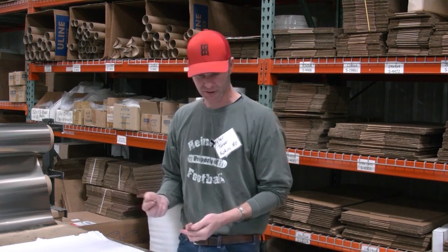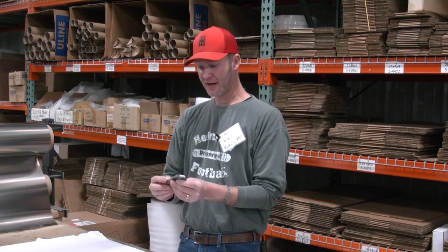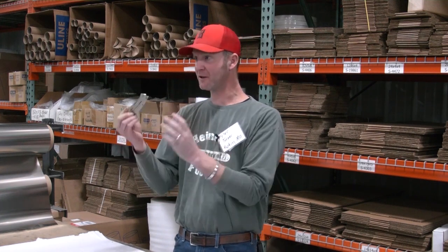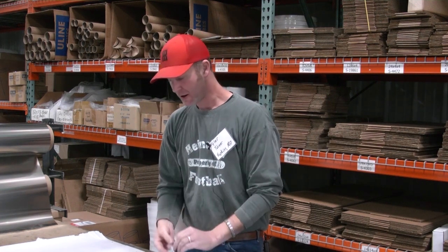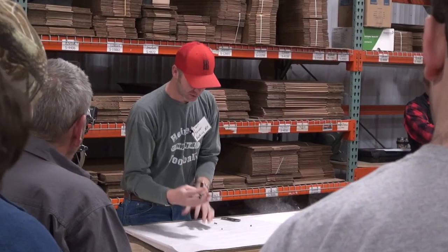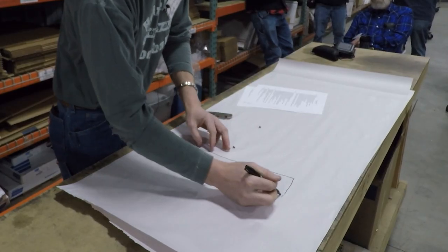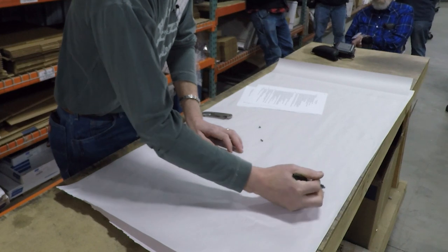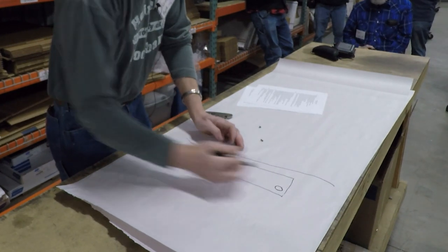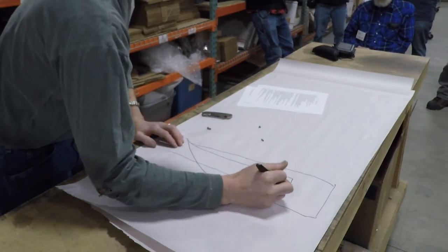So how I come up with my way to set detents is different. If you watch videos, most everybody will take the blade, put everything together, then they'll put a zip tie around it. They'll just over squeeze it, over tighten the blade so it's going past a little bit, and that's how you get an offset, because what you want is, let's see if I can draw this, your lock bar, something like that. Okay, then there's your detent hole. Well, when your blade comes down, terrible illustration, but okay. So your blade's got the same hole in it.